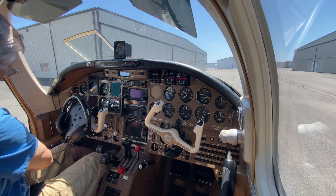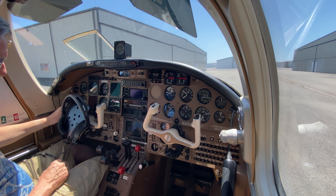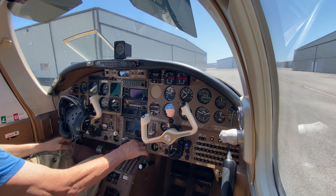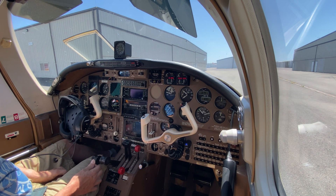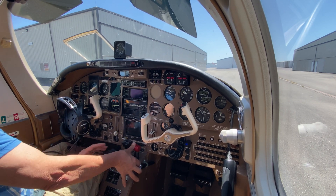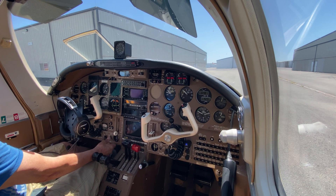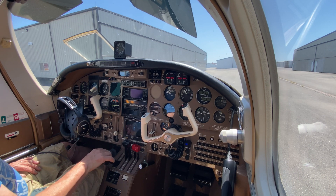Close the door on the left side so I don't have to hear it. We'll go ahead and turn the boost pump on high on the left. Throttle open: one Mississippi, two Mississippi, three Mississippi, four — back down to idle cutoff. Throttle closed. When it starts to bind, move it up about an eighth of an inch. All clear left. Run it on up. No overspeed on the start — that works really well. Low pressure's good. Boost pump to low. Hydraulic pressure's good. And back to off. That's looking all good.